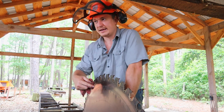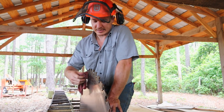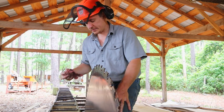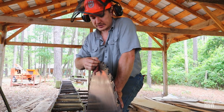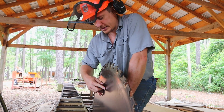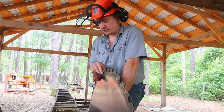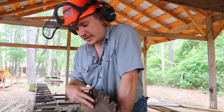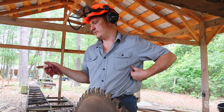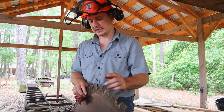Number two is making sure your saw blade is getting up to speed. This is easier if you know what RPM your saw is supposed to be hammered at. If you don't know, you should find a person that hammers saw blades. I took my plate to a fellow and we decided it should be spinning at about 550 RPM at the tooth. If you have a decent engine with a tachometer, it tells you the RPMs at the motor, and you can measure the driver pulley to the driven pulley, calculate the ratio, and determine how fast your blade will be spinning.